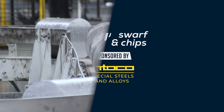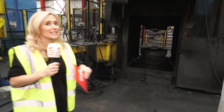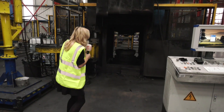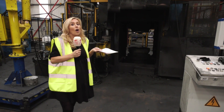So the log comes from the oven and onto the rotary forge. At the rotary forge, the billet goes into the forge at around 490 degrees. The tooling is preheated to about 160 to 180 degrees, and then we create the pancake with about 250 tons of pressure. A lot of the time the ram and pressure comes from the top, but on this occasion it comes from four metres into the ground — so there's 250 tons of pressure coming up from the ground.